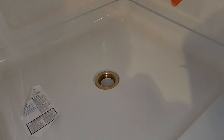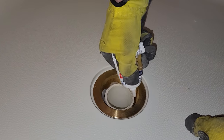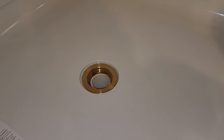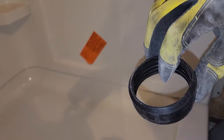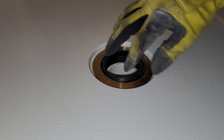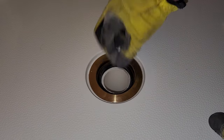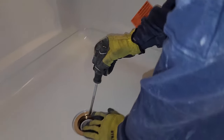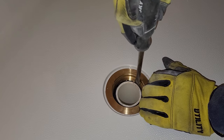Get everything nice and clean — wipe it down; you don't want debris sitting in your shower. Take your pure silicone and go around the edge of that pipe, filling the void in there between the pipe and the shower strainer. We don't have to do that part, but again, we don't want this to leak, so it's just an extra step we take. Now look at the rubber gasket that comes with the shower strainer — see how it's beveled on one end? That bevel side goes facing up. Push that rubber gasket down in there. Take a flat screwdriver and push the gasket all the way down.